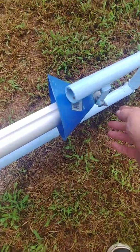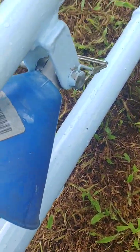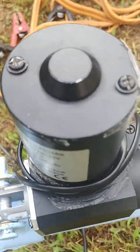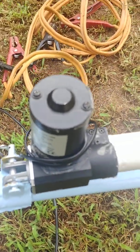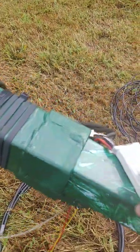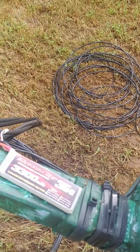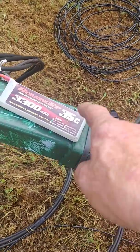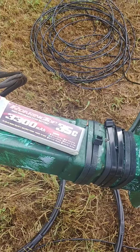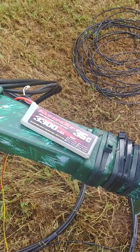I figured this is a great project. The linear actuator has pins in it which drop in real nicely, so you can take it out easily — when I had the problem this morning I just popped the pins out in about 30 seconds and pulled out the whole actuator assembly. This is the battery I was using: a little lithium battery to run the linear actuator. Because it's so geared down, it doesn't take a lot of power — only five amps. This battery is rated at 3.3 amp-hours and 35C, meaning I can get about 100 amps out of it. Enjoy — N4MQ, good day.